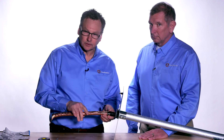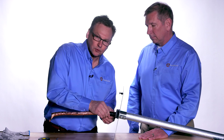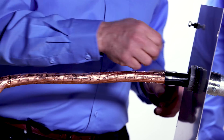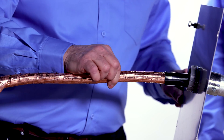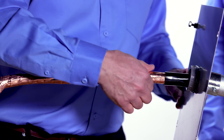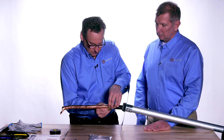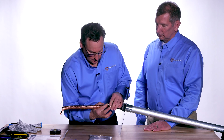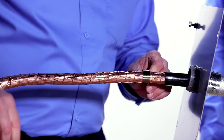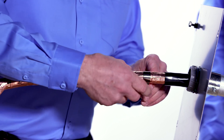The next step is to remove the copper tape shield, and we'll use the constant force spring on that also for a straight edge. Depending on how much room you have in the enclosure, you'll want to position this termination either closer to the connector or further — it just depends on how much real estate is in the termination can. This distance isn't critical; it's just what you need for the braid, which is only three-quarters of an inch wide, so up to two inches is fine.